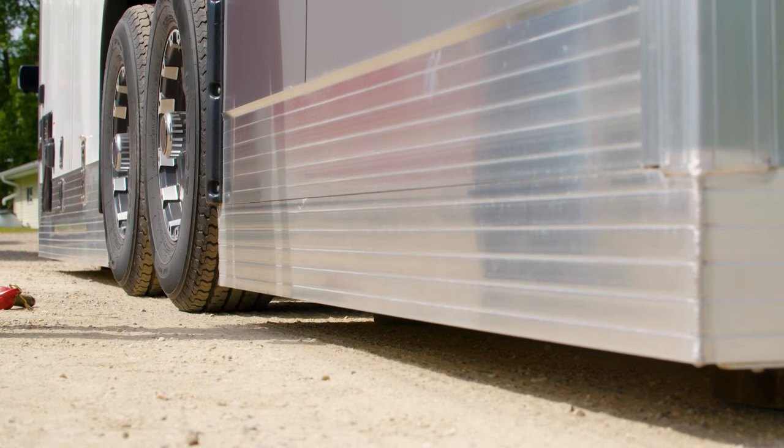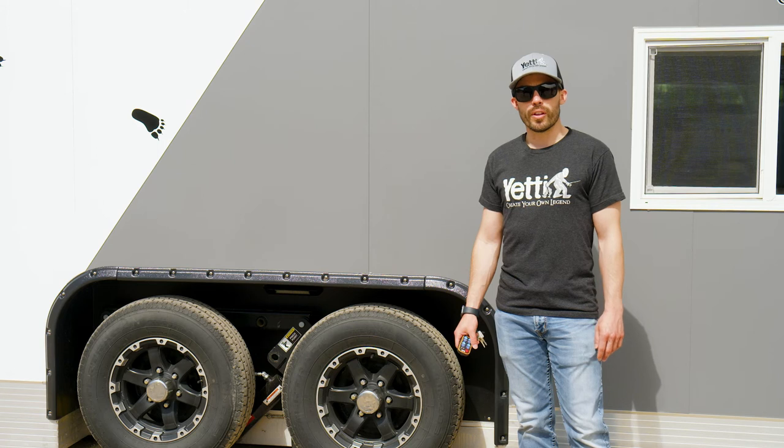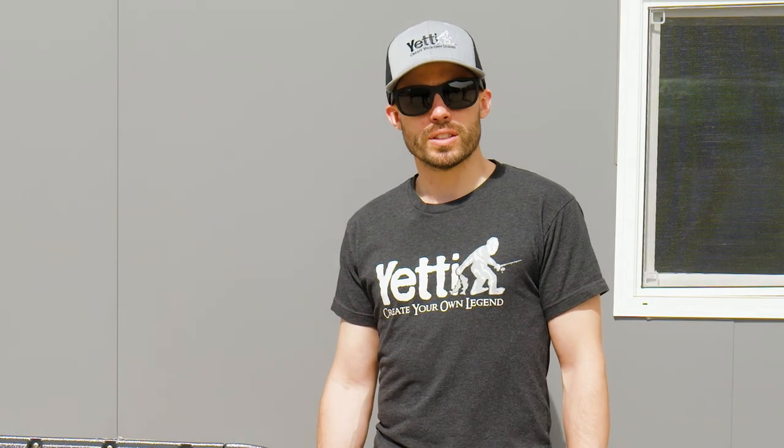Now that the house is all the way lowered, we are good to go. It's important to note that you don't want the house perfectly level when storing it on blocks — you want water to be able to drain off the house. For more information regarding your Yeti fish house tips and tricks, visit our owner's guide online at yetioutdoors.com.